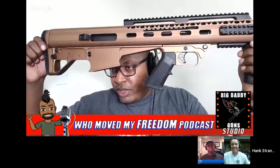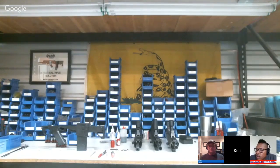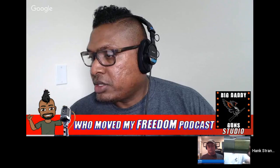So it was too difficult to really get these done, with the anodizing and everything? Yeah, it was a pain. Let me grab a couple samples real quick if we're talking colors. What happens with the colors is they can be inconsistent. So why is that, Walther, as a manufacturer? It's the anodizing process. I talked to people about doing different colors, and they wanted to get samples to establish the colors I want and test this and test that. It's a drawn out process. So it's a very expensive process on your end as a manufacturer, and then it's hit and miss, because it might not come in like you think it should, and you're stuck with it.